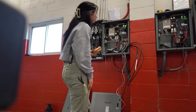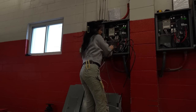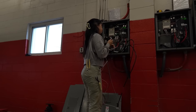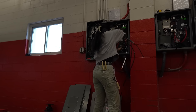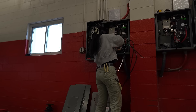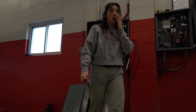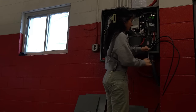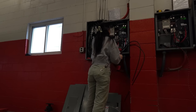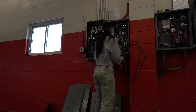It's lunch time and we are eating that fat Italian combo while we finish. I already did the right transfer switch; now I'm going to do the left transfer switch. I also have a few things to clean up on the panel side of this left transfer switch because we were missing crimps and stuff like that, and I just want to clean up some of the wiring. You guys know that I have severe OCD when it comes to panel wiring and phase taping and all that good stuff. So we're going to finish up here, torque these to spec, and then move over.